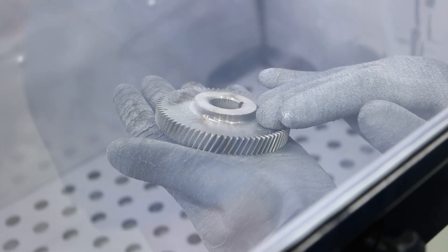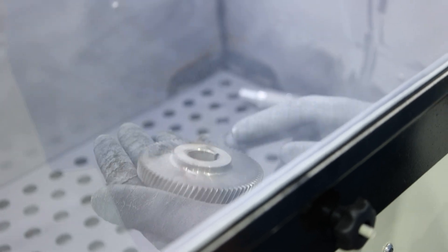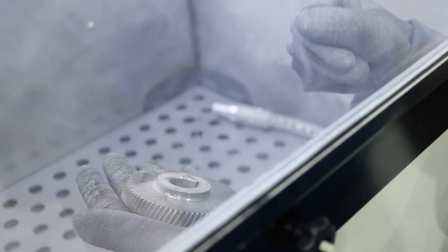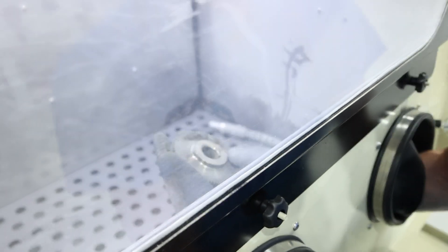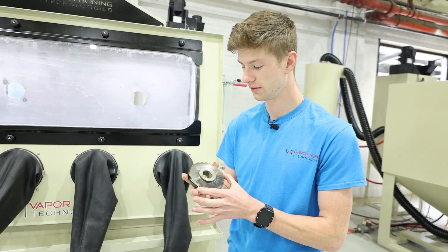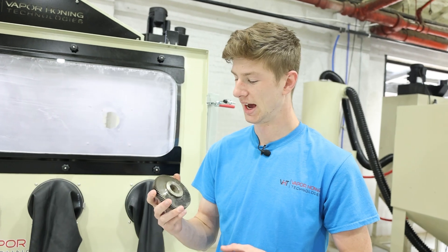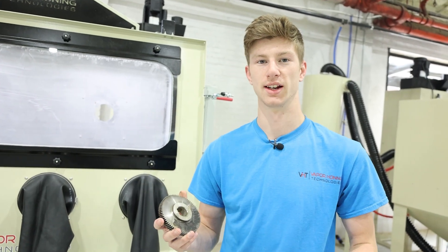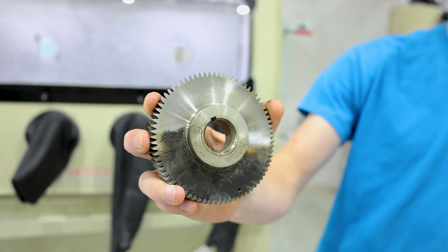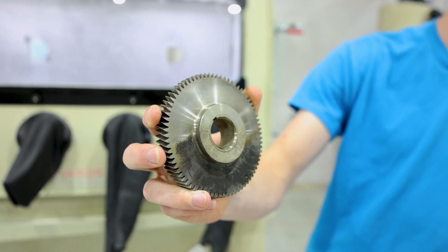You're not actually going to affect this metal. If you're blasting with something like an aluminum oxide, you would actually start to see this metal change — you would actually start to open the pores up on that aluminum because you're hitting it with so much force. But with soda, that's not a problem. I was honestly not a big believer in soda blasting because I just didn't feel like it could do enough, but this thing has made a believer out of me. I truly believe it's the pressure pot setup that this thing has, because it's just forcing that soda onto this part. And as you can see, it left us with pure metal — this top section is completely usable again.